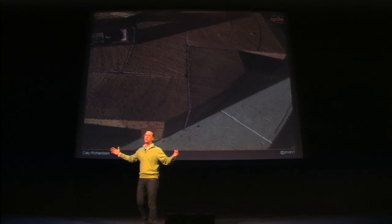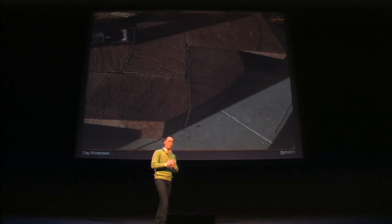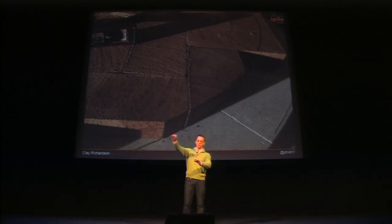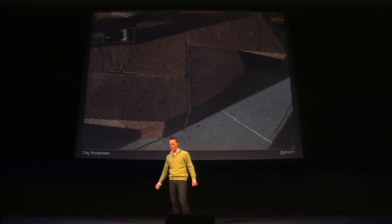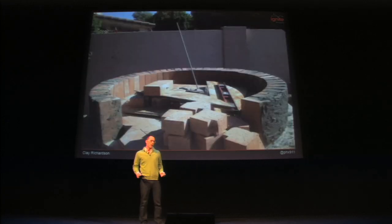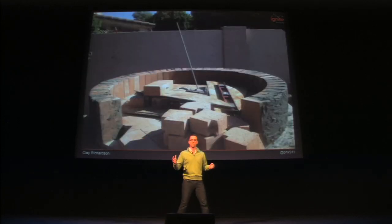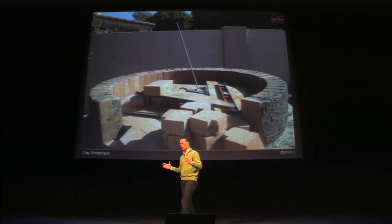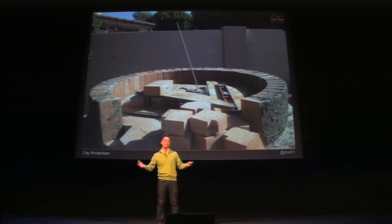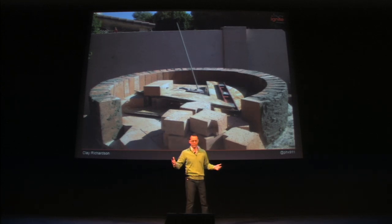So you take your Chuck Norris bricks, and you put them in a herringbone pattern, and then you wrap a circle around where you want it, and you just simply cut the bricks to form your cooking surface. This becomes your cooking surface, okay? Well, your next step, then, is that you do a soldier course, which is simply you take the bricks and put them on their end and then just wrap it around the circle you just made. This becomes the base of your dome. It's also the first course in your dome.